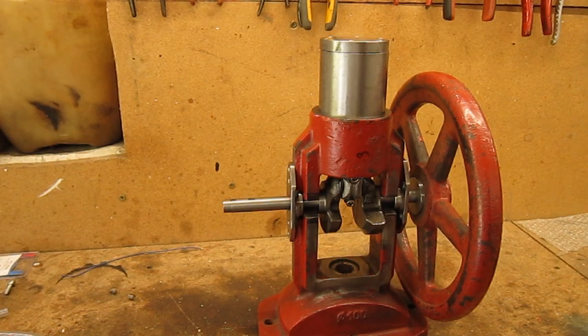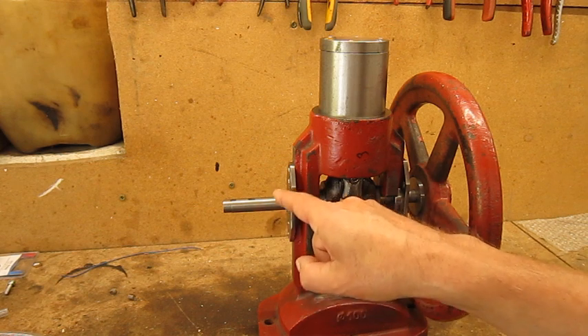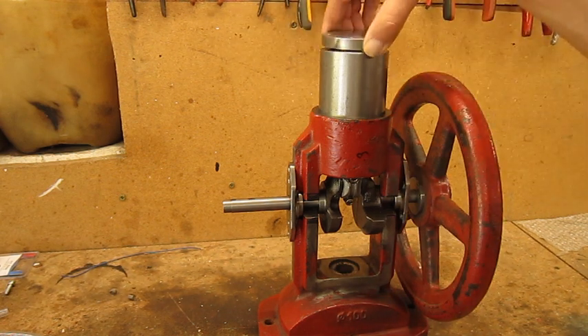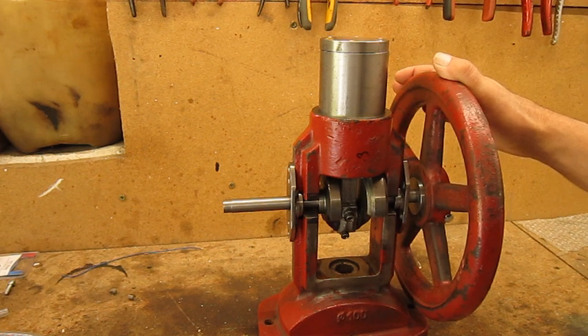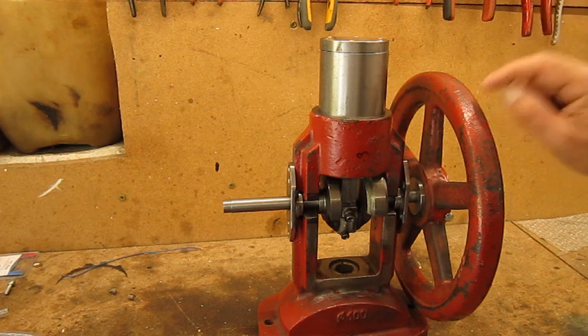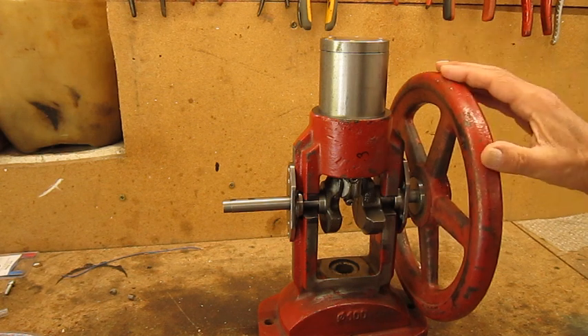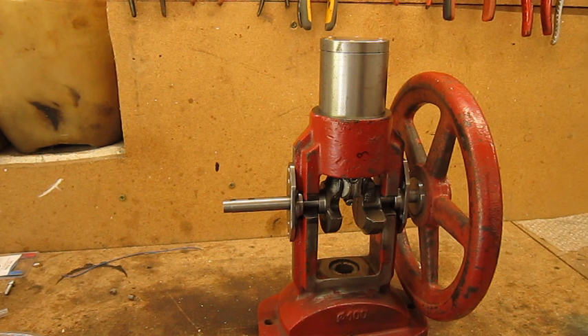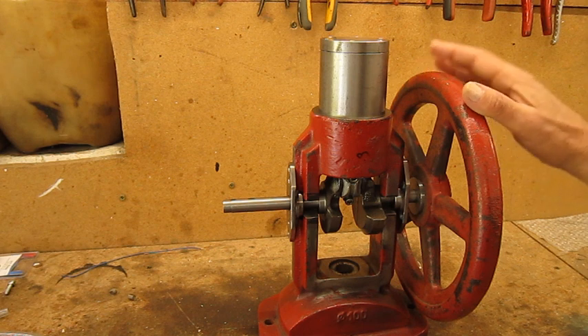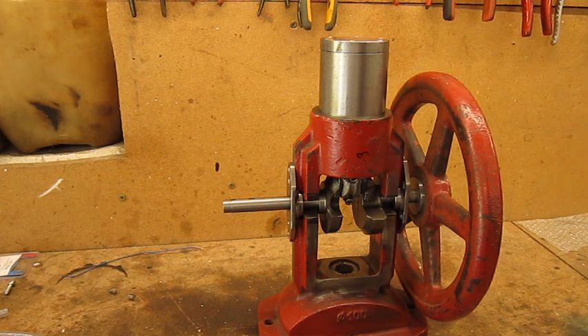I'm ready to start what could be the most complicated part of this build. Now we have to do a little more precision work — this for precision was not too much so it was rather easy. What I want to do is build a valve system over here on this side, so when the piston is up air comes in and pushes the piston down, and when the piston is down air goes out again. With the inertia of the flywheel, the piston goes up again, so it's only one working stroke and not two. I looked around here to find some raw materials, but I didn't have what I needed, so I cheated a bit and bought some beautiful new toys.